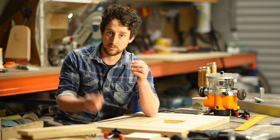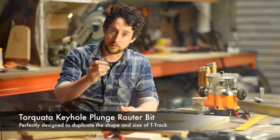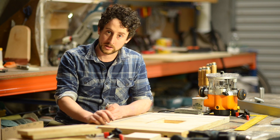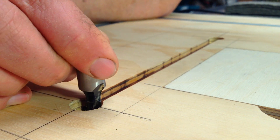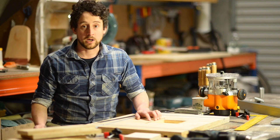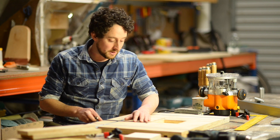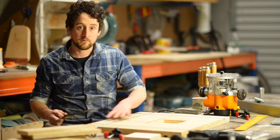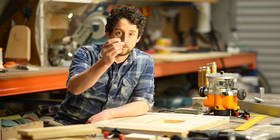You need to make sure that the hole you're drilling on each end with your Forstner bit is larger than the keyhole bit itself, so it can enter freely. You also need to make sure the fence allows the router bit to travel exactly from the center of one hole to the center of the second hole. I actually did mine on the router table — I just measured the distance from the center of the router bit to the edge of my piece and ran that edge along the fence.